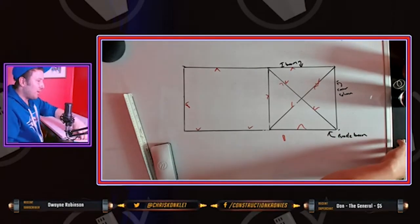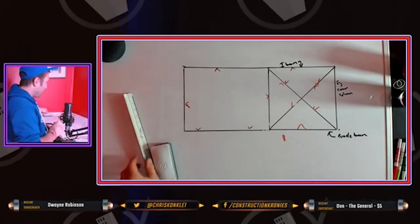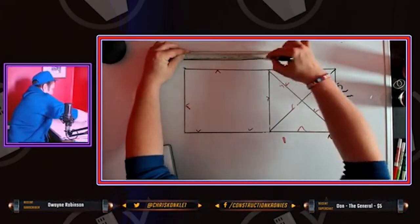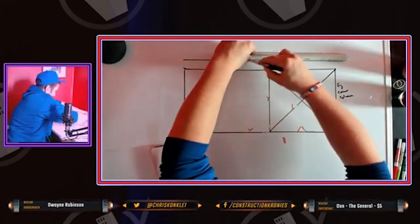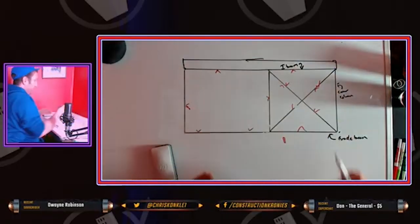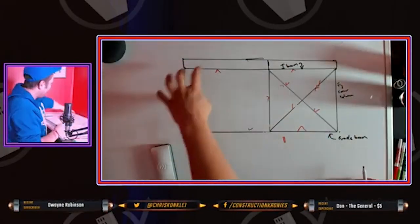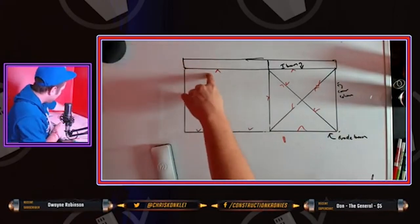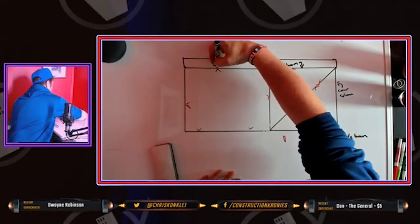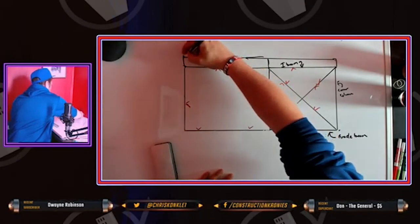Because what you really need to understand is the parapets, guys. Because what you have here is going to be kind of crazy. It's always crazy. You got a big I-beam here. Think about this for a second. You got a big I-beam, or you got steel that runs, attached together or whatever. But anyways, it's a big gap between your steel stud. And this beam is usually 2 feet wide, and then you got your Q deck on here.